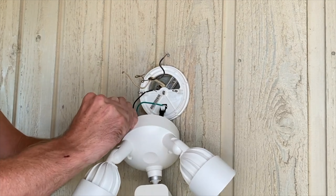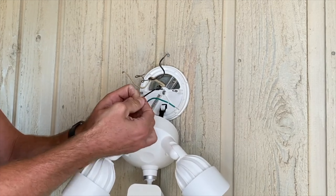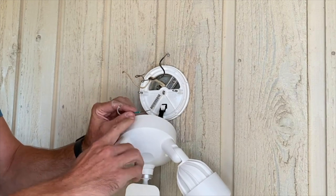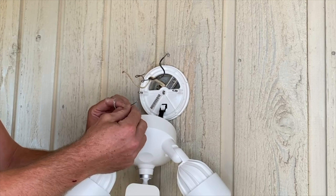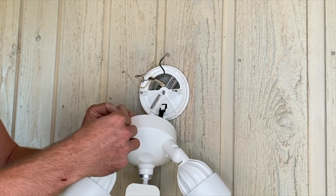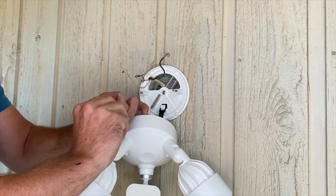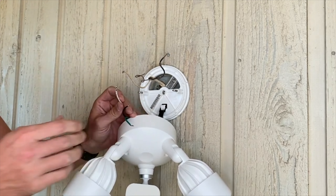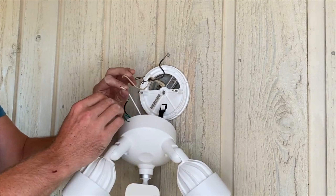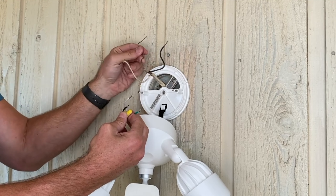To wire these on, you'll need to remove the little insulation that's sticking out there. The wire comes pre-stripped and they leave you with an awful lot of wire here — your wire nut is not going to cover all of this if you just go to stick it on. So you can either cut some of it off, or I'm going to try to just fold it in half and twist it up. Once you have your wires all prepped, you'll need your wire nuts. The included wire nuts are kind of small, so I'm going to use some larger ones. White to white, black to black, and green is the ground — which is the uninsulated wire right here.